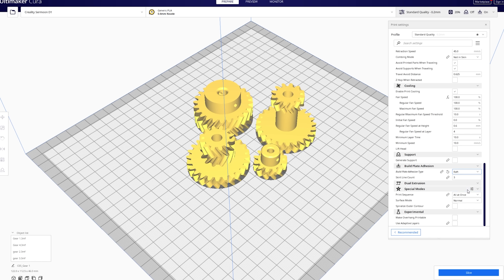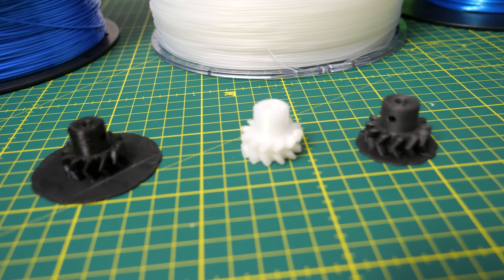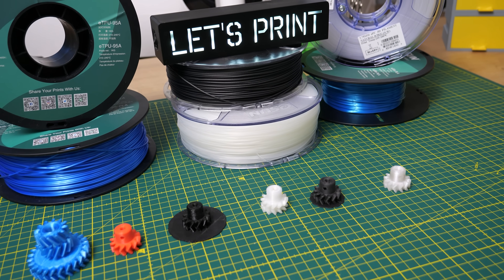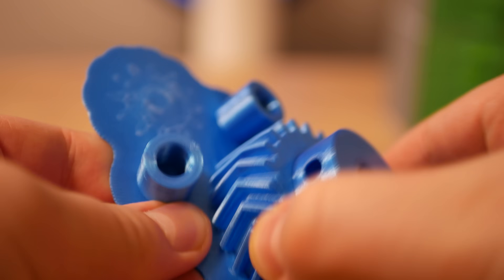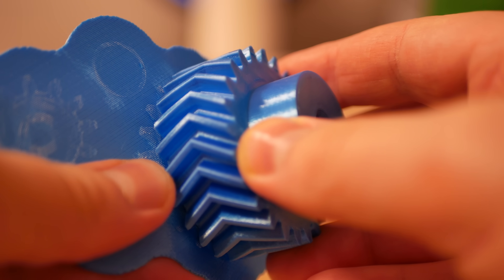But with what material? There are a lot of options: PLA, ABS, ASA, PETG, nylon, carbon fiber nylon, and PC. Every material has pros and cons, but I have a lot of experience with 3D printed gears and I'm not afraid to say that 90% of the time you don't need any material other than PLA. Of course if you're using the gearbox on a hot summer day outside, PLA won't work — but for this gearbox, PLA should be absolutely fine.